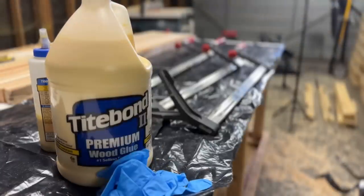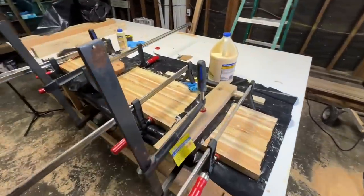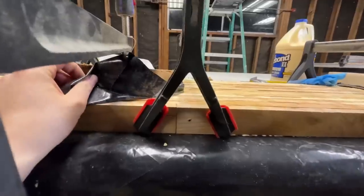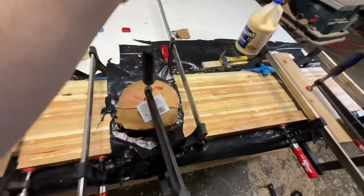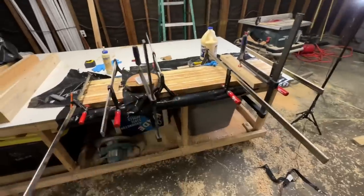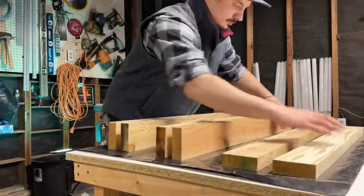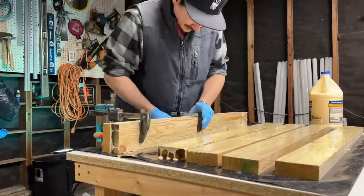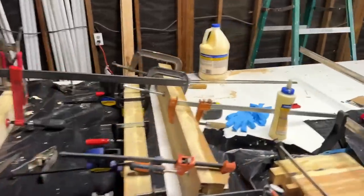Now for some glue, gloves, and clamps — we're ready to do our glue-up. Unfortunately the camera died in the middle of it, but basically I have five horizontal clamps. I have these cool split clamps here which are great because when you have a seam you can put these right on it to make sure no board is lifting up. I also have two clamps putting pressure downward to keep this flat — one here and one here, two wide-mouth clamps. I'm going to let that sit overnight. Next I'm going to glue up our legs. I just turn on this little radiant heater and leave this overnight.